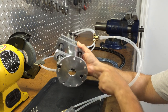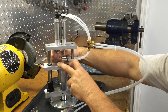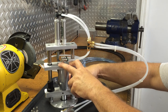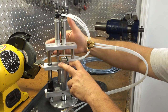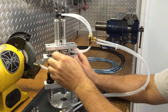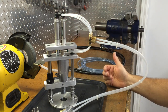the 3/4 inch socket. And what I did is I put these adjusters on these rods right here. It'll go down further when it's not on the machine, because you've got the drawbar there to stop you. So I have it set so these don't bottom out, so they're not slamming the cylinder. They're stopping and slamming on the drawbar. So basically one cylinder works for in and one cylinder works for out. And then the bleed valves, of course, bleed off and allow it to come back up and retract.